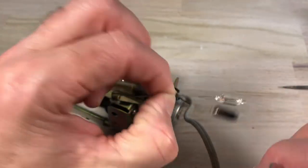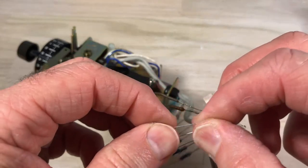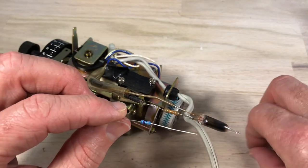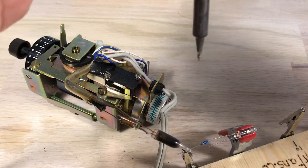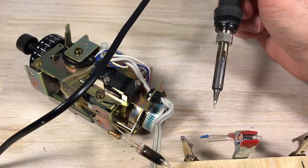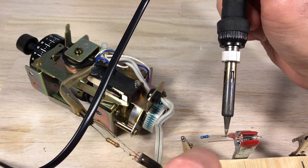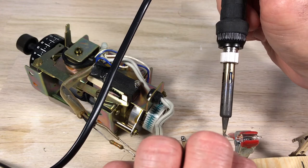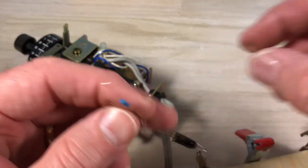What I'm doing is trimming the leads here, imagining where I'm going to put my resistor, so I'm trimming the leads to match what I've got. Here's my resistor — I'm going to do the same thing and trim back the leads a little bit based on the needs. Based on the light here, I want to try to do it right so I don't end up with too short or too long a bulb when I'm done. What I've got over here is a jig I made — something I use a lot. We've got the resistor and the bulb, the wires are lined up. You want to heat the wires — you don't want to melt the solder on the wires; you want the wires to kind of melt the solder into them. That's a better way to solder.